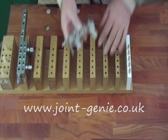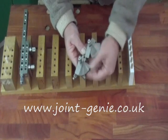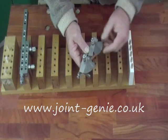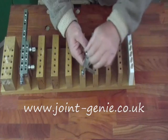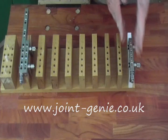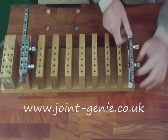Joint Genie spacer tabs for centering on any thickness of material. Here's a professional bar kitted up with all the tabs. On each post it has seven one-millimeter increment spacers, and the top one is a two-millimeter thickness spacer, which is the final clamping one. If you use them all as a single block down, make sure they're always tight — you can apply this to standard melamine face chipboard. This will give you a central column of dowels dead centre in the middle of the material, because the bar is the same thickness, designed specifically for kitchen furniture and bedroom furniture with a single row of dowels.